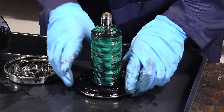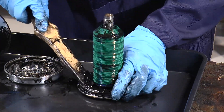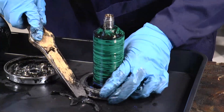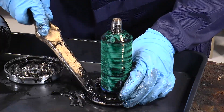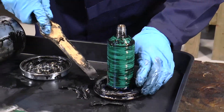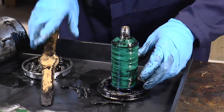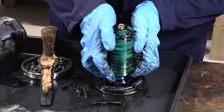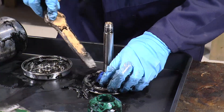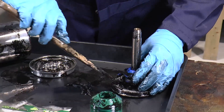We have our distributor plate which is dirty, so we need to use our tool — our spatula — just to clean away any sludge cake and carbon deposits. If the sludge has gone down between the distributor impeller, you may need to just lift up, in which case you can take the bowl discs off and just lift up gently the impeller before cleaning.